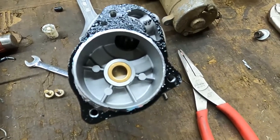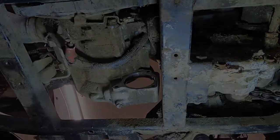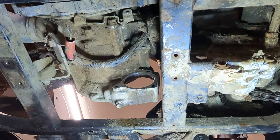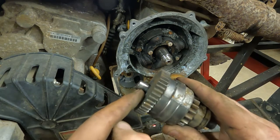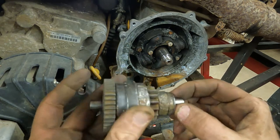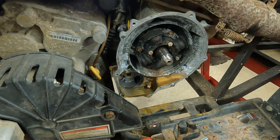I got the surface under the motor all cleaned up and I got some Yama Bond on this, and I'm going to stuff this back in there — just going to get these three bolts started from the front and worry about the back afterwards. This surface and this surface here are pretty important because they ride in a brass bushing on each side, so make sure there's no rust on that when you go to stick it back in. I'm going to put a little bit of grease on each one of these so there's a little bit of pre-lube while we assemble it, and I might even put some grease in the teeth of the gears just because it ain't going to hurt it.